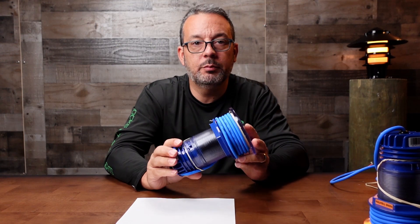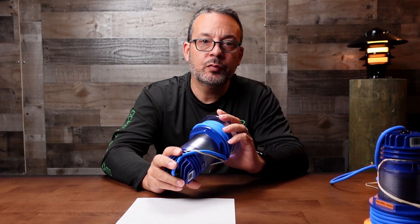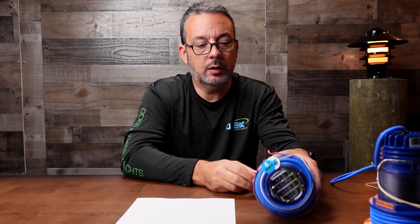They're made of a polymer plastic housing, so there's no bonding required, which also eliminates any issues with electrolysis. So if you ever had problems with electrolysis and noticed your metal through-hulls being eaten away, that's not going to be a problem with these.